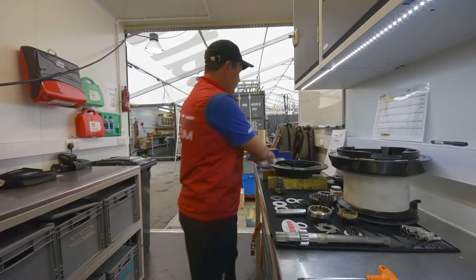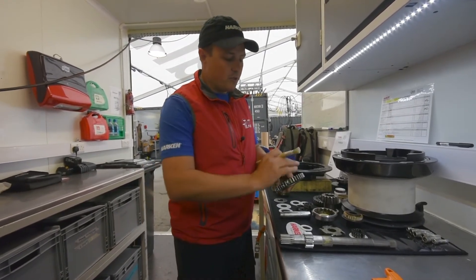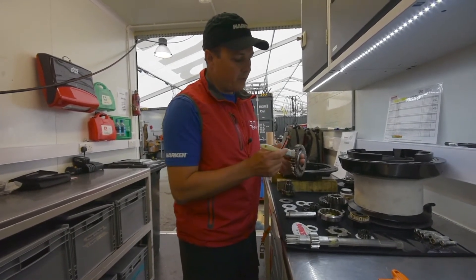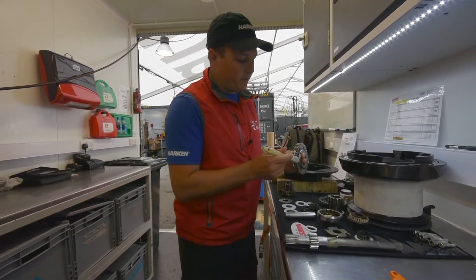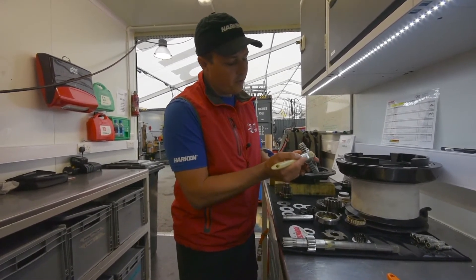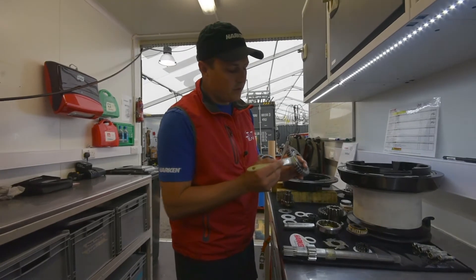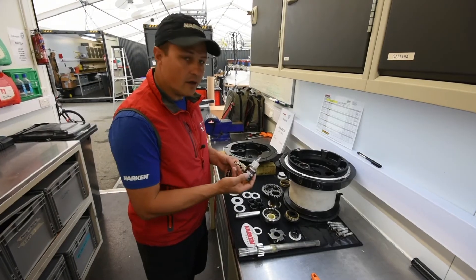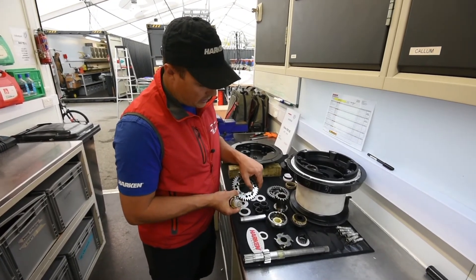The key is not to put too much on. If you put too much grease onto the winch, the grease will disperse around and go into the pawls, and then they stick. So by putting a small amount of grease on each tooth, that will protect the gear but mean it will not spread around the winch. Notice also, I'm moving the brush from this side to this side, not from this side to this side. The reason being, if we get any lumps of grease, they're away from the pawls and we can just easily brush them away. We're now going to add the Harken pawl oil to each pawl, just squeezing it in behind the pawl and working it into the pawl.